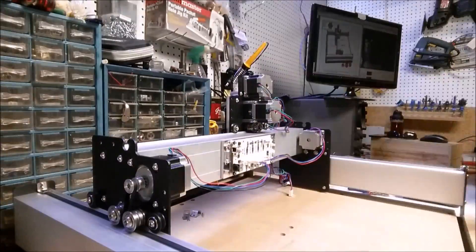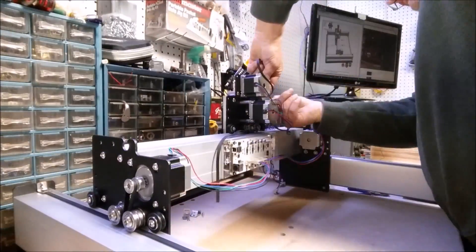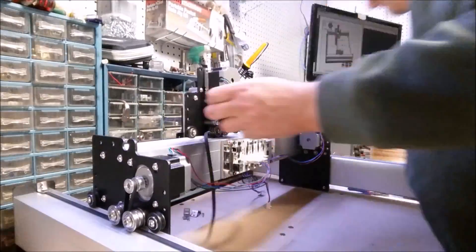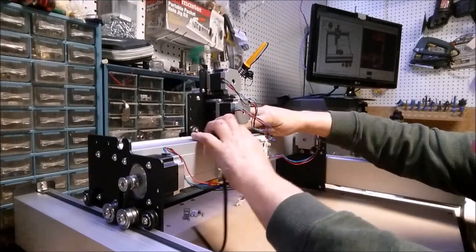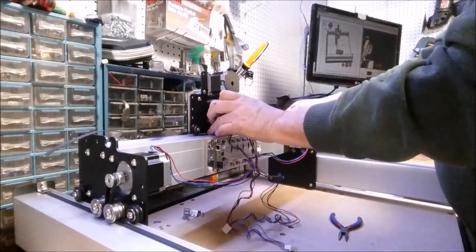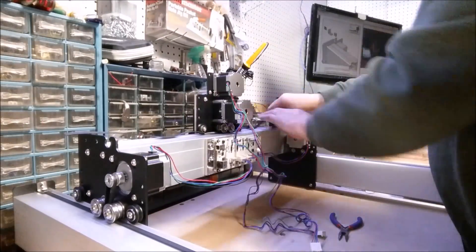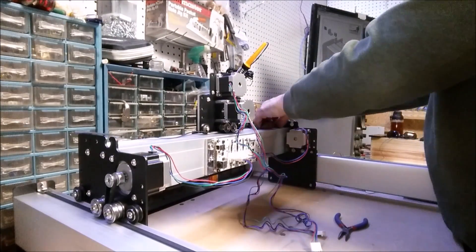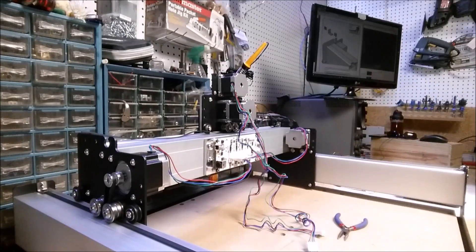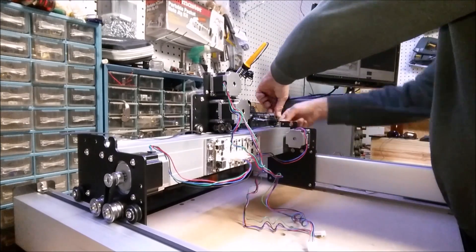We are almost done. For the last real mechanical step we're going to install the x-axis drive belt. As before, mark the middle of the rail. Here's where I broke away from the instructions: I measured and marked the center of the drive belt with a pencil, then installed it by draping it over the servo drive wheel and threading it under the two belt guides to the brackets. I rolled the servo over the center mark on the rail and marked where the ends of the belt would go into the end clamps, then used those marks to thread the belt into the clamps. After taking up the slack with the servo I tightened it down. This method worked fine for me — I was just frustrated trying to get the belt under the guides on the x-axis rails the other way. The instructions would probably work just as well as long as the end result is the same.